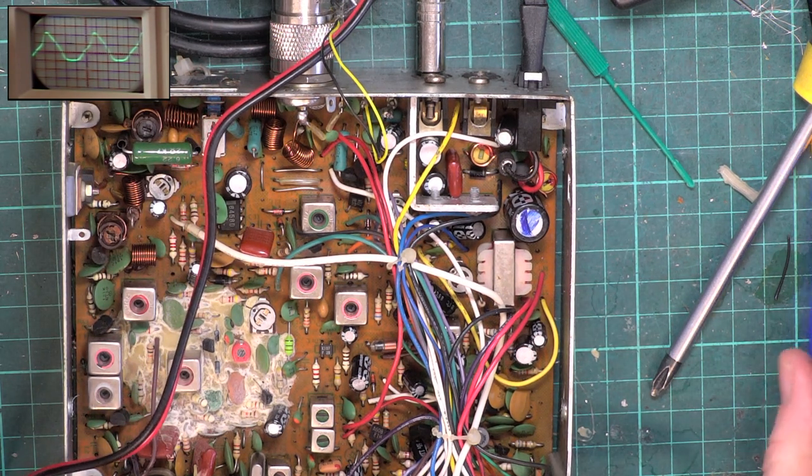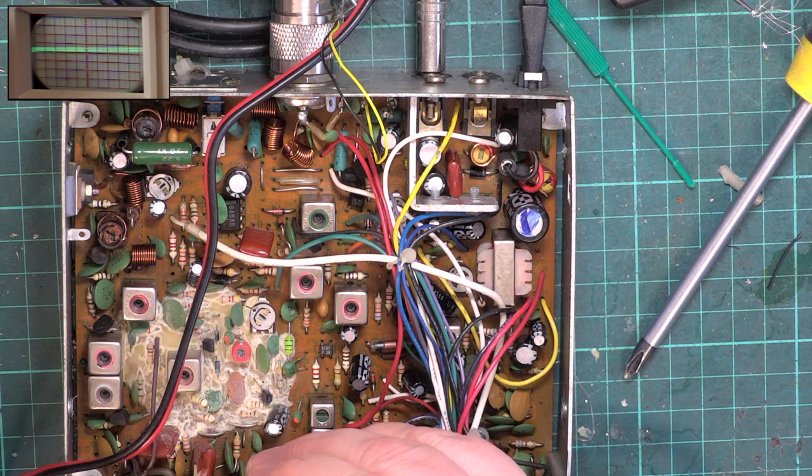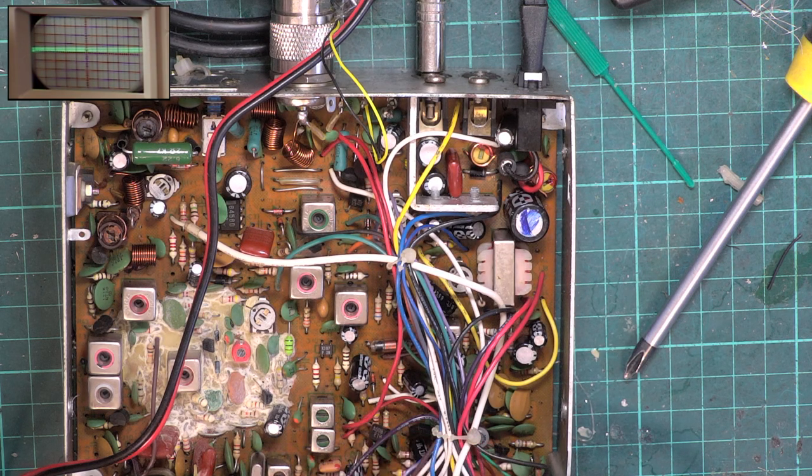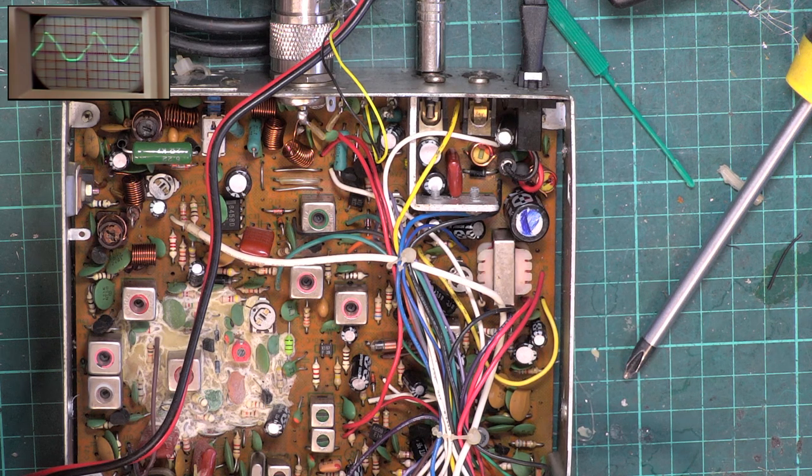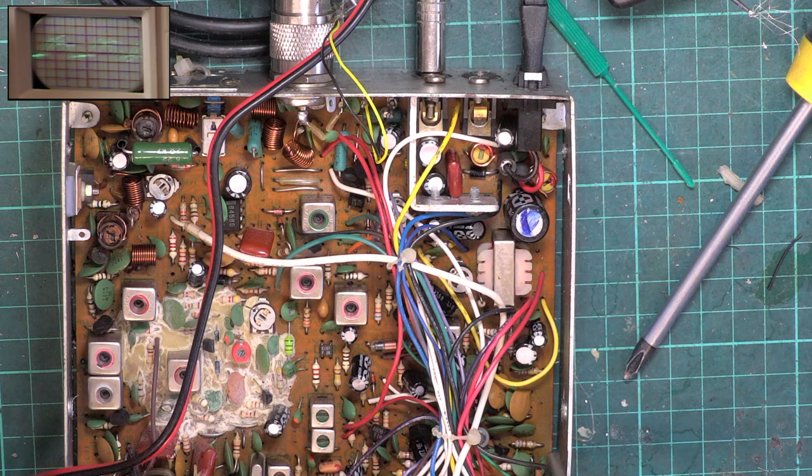Should check if it's still on frequency. It's dropped a fraction as it's cooled down, so I'll deal with that. That might help. So where's its sensitivity? Well, for 12 decibel SINAD, we've got 0.65 of a microvolt. For 10 decibel SINAD, we've got 0.55 microvolts. And I don't think it will achieve 20. No, it won't. 18's the best it'll ever go.